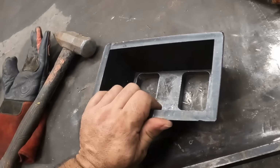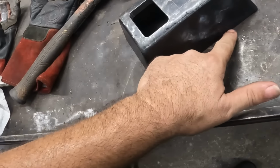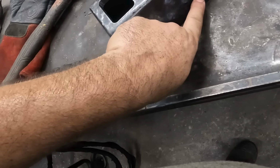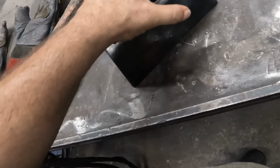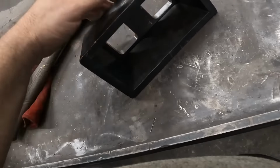Still gonna have to make some custom jaws to where I wanna be able to clamp it in there, but not clamp on that edge, okay? I kinda want them to sit on the jaw and then the jaw clamp up here somewhere, mainly on the two sides here, or actually on the ingot. It's not gonna matter, it's gonna be solid, but I don't want it clamping on the edge. So that's gonna be a next project. And I think what I wanna do is probably make them out of copper, so that the copper's touching copper and not hard metal touching the copper.